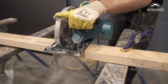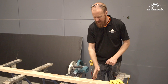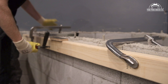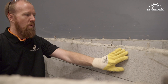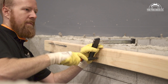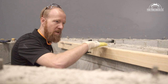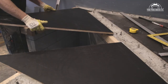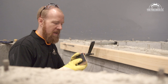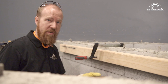I've got a circular saw here — if you have a drop saw, use that. I've measured out my length of timber and I'm going to cut it — it doesn't have to be cut perfectly square, just roughly to that length so it gives me support along that whole section of blockwork. Before we put it on, just make sure the surface is clear using a trowel. The plywood we're going to use to create the floor is form ply — a film-faced plywood that's incredibly strong and commonly used in concrete work here in Australia.